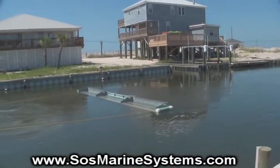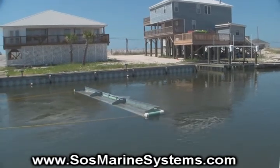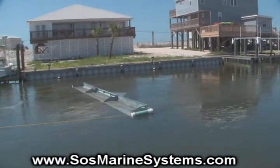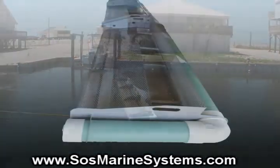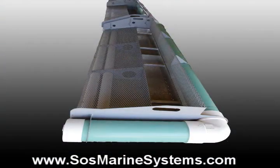I have invented a shallow water oil skimmer — a very simple oil skimmer — thus the name SOS. This skimmer is made and sold in eight-foot panels that easily connect together to make between eight-foot and 32-foot wide skimmers. The SOS has an inclined front panel made from expanded metal dropping off in a basket in the rear with a tall back screen.